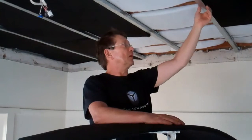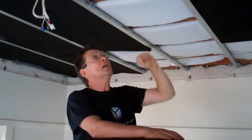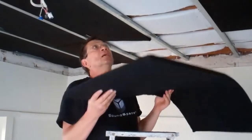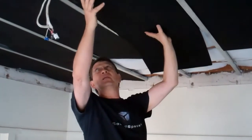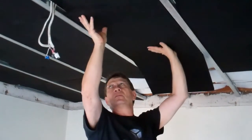So now we have installed the resilient mounts and the furring channels. Normally I have the existing ceiling still in place — in this case I had to remove it. But when we install the second layer of plasterboard on the furring channel, we create a new cavity. Once you have a cavity, you always have reverberation inside and the sound increases — sometimes it doubles. So to prevent that, we install another layer of high density acoustic batts between the existing ceiling and the new one. It helps to reduce and eliminate the echo and reduce sound transmission.